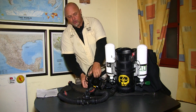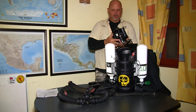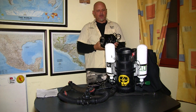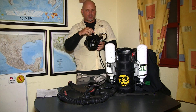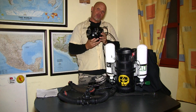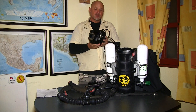Now we are ready to put the head in — it is on, it's calibrated, it's good. One more time, I'm checking if the O-rings are sitting in. The very last thing: you want to make sure there is no hair crossing the O-rings. There's not really a lot of danger with me putting hair on the O-rings, but you may have more hair than me, so be aware.